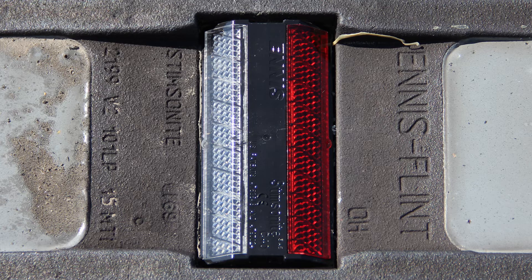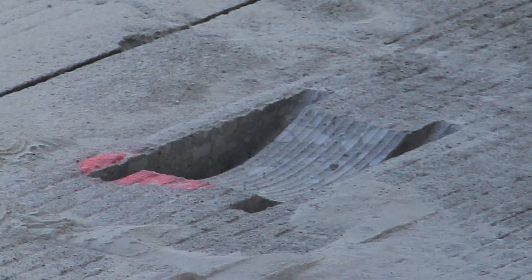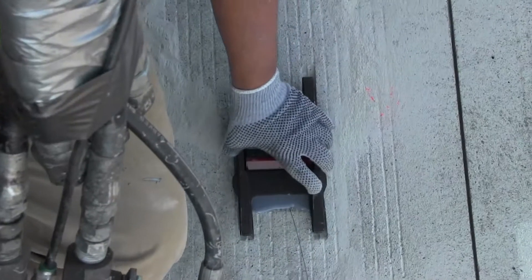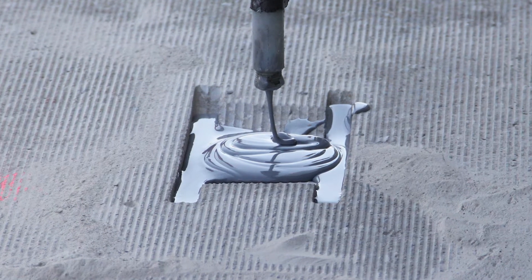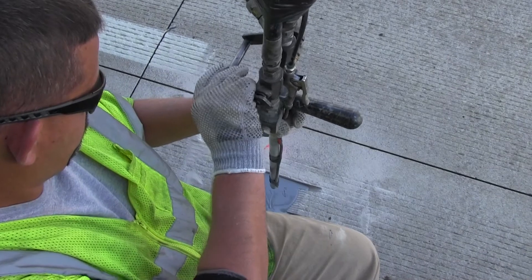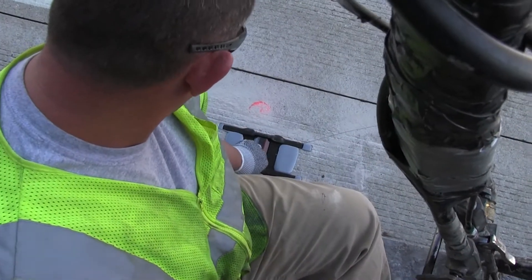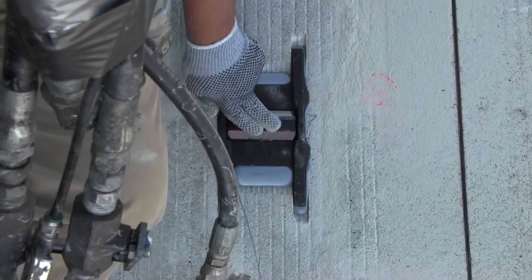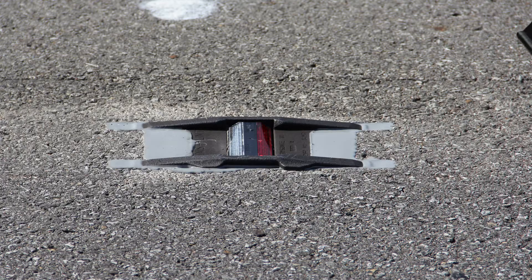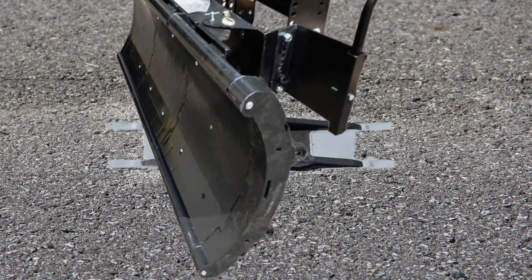Each 101 casting features a C40 reflective marker in the casting bed. The casting is placed in a plunge cut with all four leveling lugs contacting the pavement while using an epoxy adhesive for adherence to the road surface. The leading edge of the casting must lie below the pavement surface. The casting's hardened iron allows the product to withstand snow plows, heavy vehicles, and other road hazards. Ramp angles are engineered to improve plowability and decrease reflector damage.